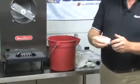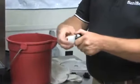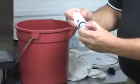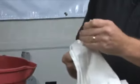I'm going to unscrew the knob. Push on the rod to get the spigot plunger, spring, all of that out. Going to unscrew the rod. Going to get these two O-rings off. It'd be a little bit easier if you wipe off the lubricant that's on there. Go to a dry spot, again, pinch and push up, and it rolls off.